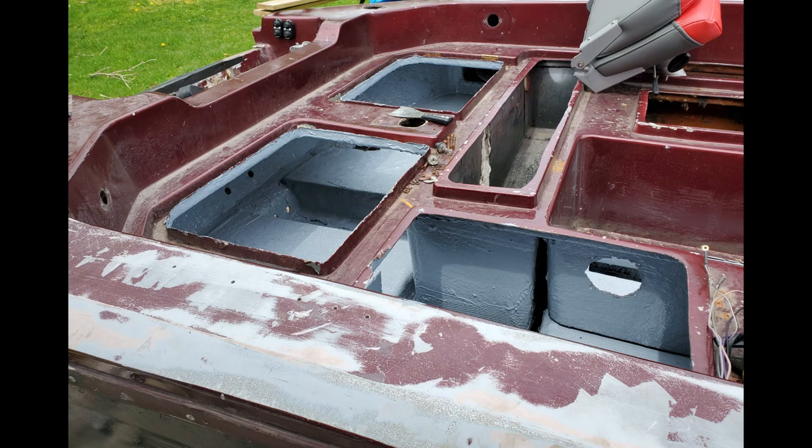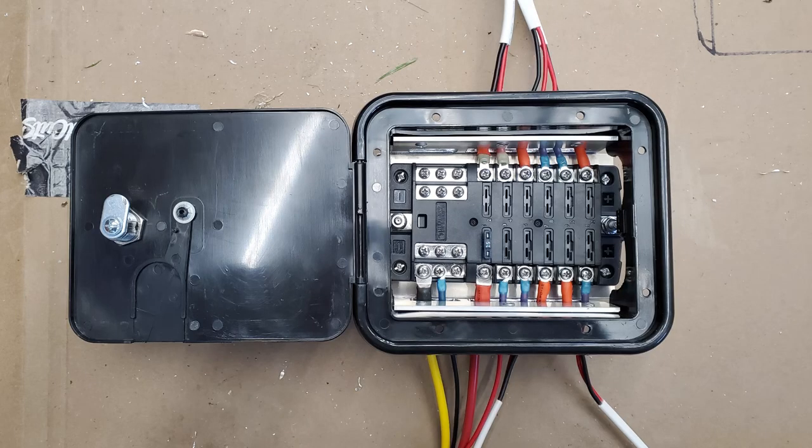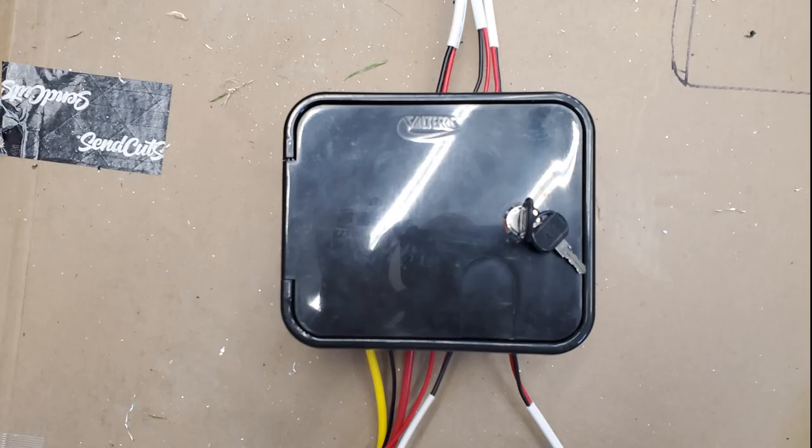Removing the floor allowed full access below the deck so I could clean, degrease, and apply several coats of high-quality epoxy bilge paint. On the helm, there was originally a blown-out 5-inch speaker and a shore power plug. These got tossed, and I added two new shore power plugs to provide easy hookups for my new onboard battery chargers — one for the house battery bank and the other for the trolling motor battery bank. The original single speaker was mounted in a really bad location, so I opened up the glass around it and fitted in a watertight access panel that would house a proper fuse block that was dry and easy to access.